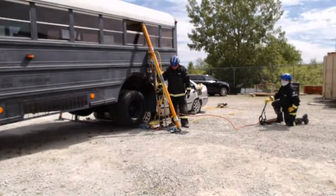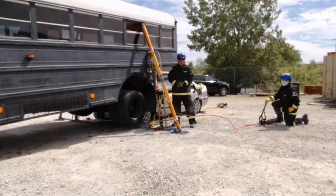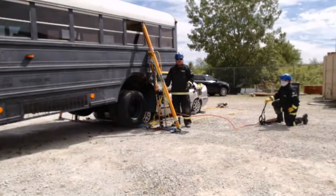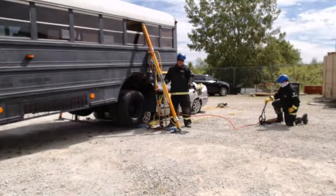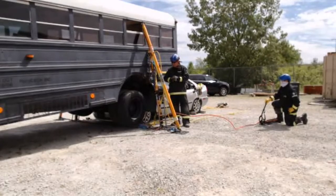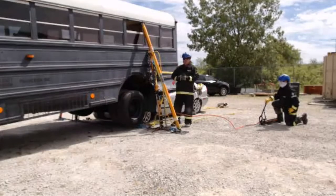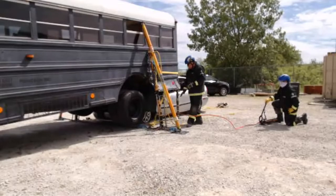With my lifting devices, I decided to use pickets. Reason is I can't see a line of sight to the other base. The front end of the car is there. And if I were to use ratchet straps or chain on this, I'd be ratcheting on the underside of this vehicle. I didn't really want to put anybody on the underside of this vehicle until it's all safe and tight. So I opted for pickets on this one. There are pickets in that big kit. So we're trying to show a little bit of everything. So my chain hook is on. Everything's locked out.